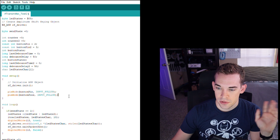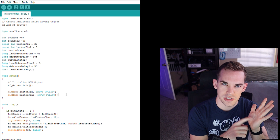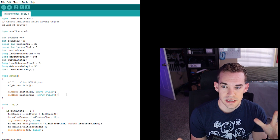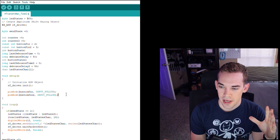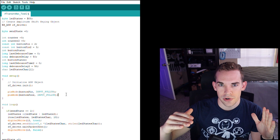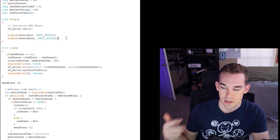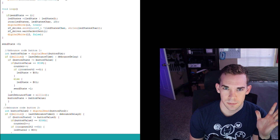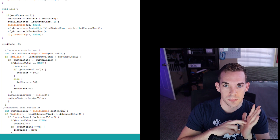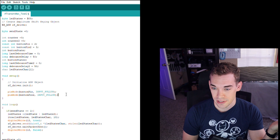In the setup, I set up the two button inputs. A trick I learned: with these numpad deals, they can act like capacitive touch sensors where they'll go off if your finger gets close to them or even on their own. To fix this, I made the inputs INPUT_PULLUP, which in Arduino actually adds a synthetic resistance — it sets the threshold of what an actual trigger is a little bit higher. Now going into the loop, I have an if-send-state equals one, meaning it's only sending a signal when a button is pushed. The rest of the loop is: when it detects a button push, it reads which button it is and sends that corresponding byte information to the receiver. I'm sorry if this is going quick — I just don't know how to make this entertaining.